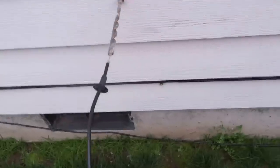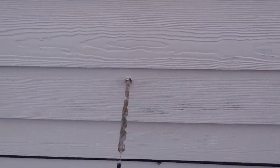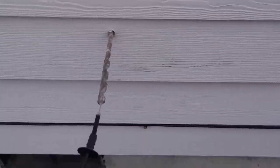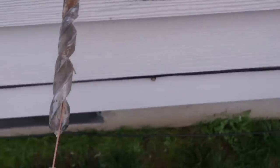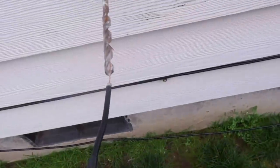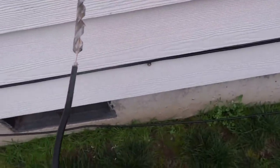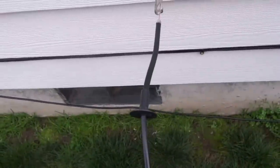So I'm running an outlet. On the inside I just found where we're next to the other outlet at equal height, there's no stud, and poke this drill bit through so it has a hole in it. Strip the cable back with your prep tool, and then I run one of these on there so when I pull that back through, put an outlet on it, pull it back.